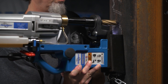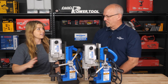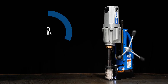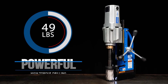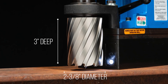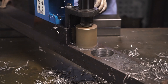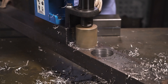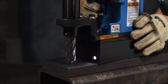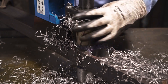The 920 is a big jump — much bigger capacity. It'll actually do three inch depth and up to two and three-eighths inch diameter. Depending on what a customer is doing, whether they're stacking plates or dealing with thicker materials for heavier jobs, that machine has a two-speed motor, built-in coolant bottle, the ability to do a swivel base, and a larger drill chuck because you're going to be using bigger core bits and things of that nature.